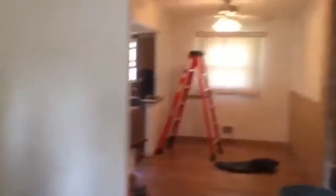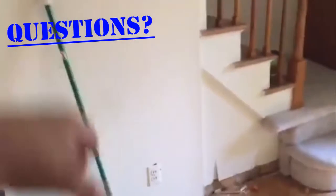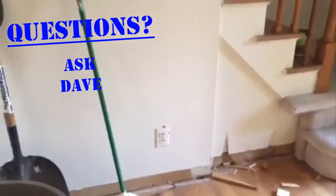There's not much here. Over here you can see the oak flooring. This oak flooring is all coming up. Remember now, just to get an idea, we're opening up all these walls here. Everything's getting opened up. It's going to be a full kitchen, a bathroom by the entry. We're putting in a steel plate all the way across from that wall, all the way down to that wall. It's about 32 feet long. And that will enable us, this homeowner wants to open up the staircase here and have it look down with a railing down to the basement, which will be eventually a finished basement down the road. So they want all that open and exposed.